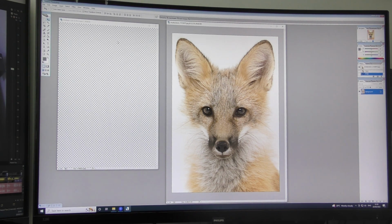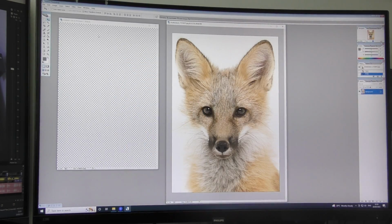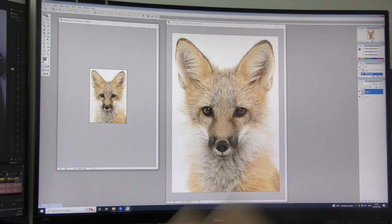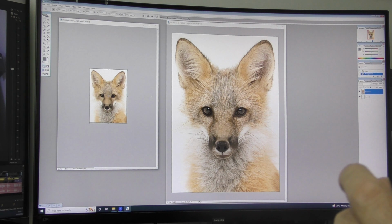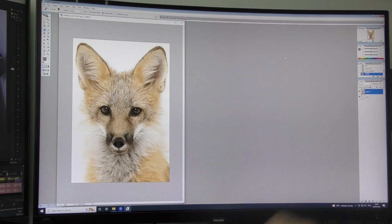And I'm going to transfer it into something that I can print on my laser machine. Now, I know, because I've done experimentation and created lens systems that allow me to produce dots on my material, which are 0.1 diameter. So what I've done, I've set this image up here so that it's got 0.1 square pixels in the image. I'm not going to tell you what I'm doing. I'm just going to show you that I'm going to size that picture to fit in the A4 frame. And I've set the resolution of that picture to 254 pixels per inch, which means each pixel is 0.1 of a millimeter square. I think previously we had 300 pixels per inch in the image, and this is now 254. So we've downscaled the picture, which is a very important part when you're playing with graphics. Try not to upscale a picture, always try to downscale it. I know that I can put 0.1 dots down to simulate each one of the pixels on that screen.